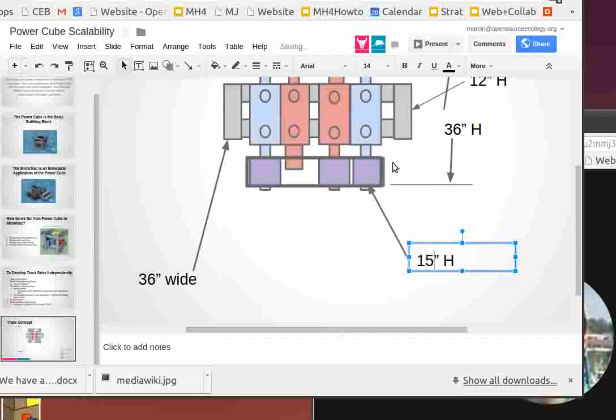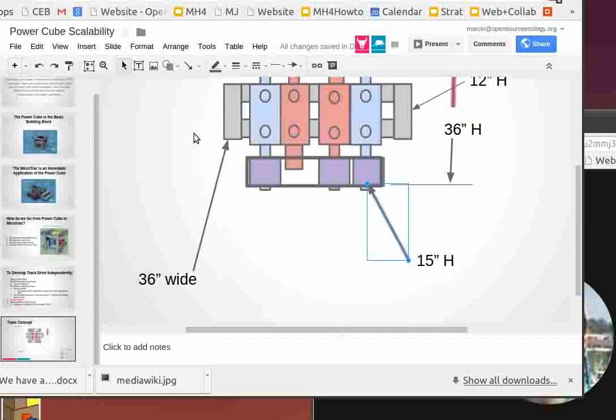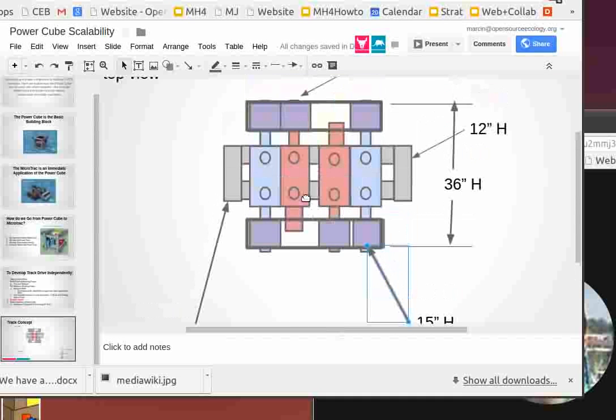Which means that each drive wheel, if you go through the numbers, is 15,000 inch pounds for each one of those for the hydraulic motor. 15,000 inch pounds means that with a 15 inch diameter wheel, a drive cog or drive sprocket, you have 2,000 pounds of pushing force. In other words, this device, what we drew here conceptually, is guaranteed 4,000 pounds of traction. Well, of rotational force. That means if the tracks grab the ground perfectly, you would have up to 4,000 pounds